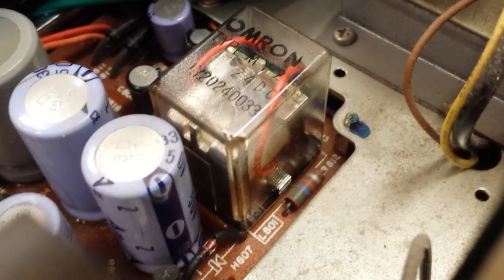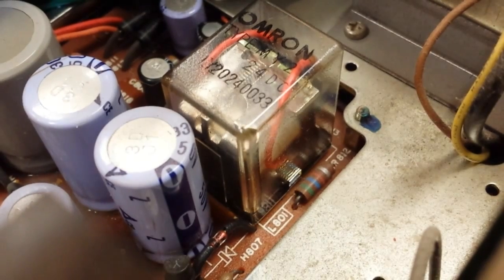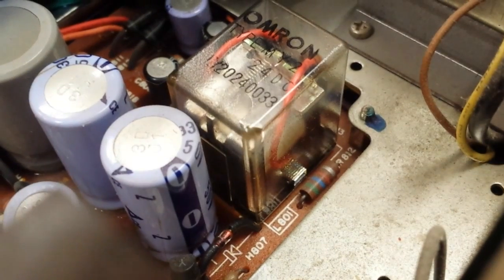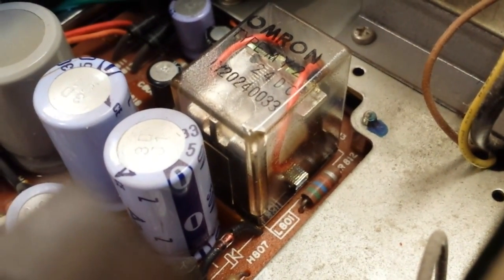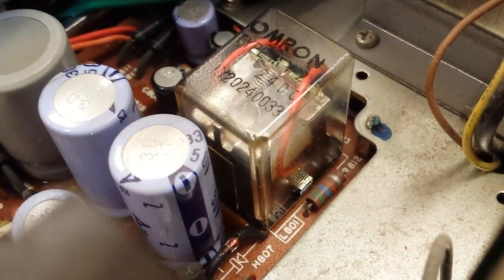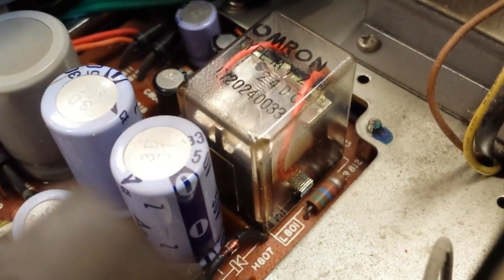It requires two hands so I can't really do it holding the camera. The other option is to mark the wires underneath, unsolder them, and pull the relay out. You can replace it — I believe you can get these OMRON MY2 series from Digikey. If you can get the relay out and apart, then you can burnish the contacts, and that will tremendously improve its life.